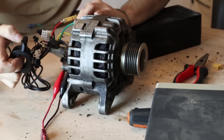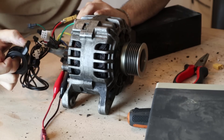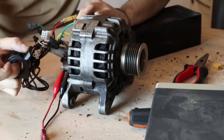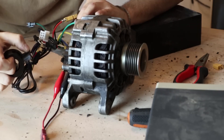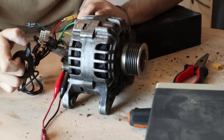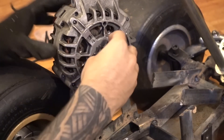Connect your battery. I'm using a lithium one, but you can use a car battery or any other with the correct voltage. This one is 36V, but there's a 1500W controller that uses 48V, so connect a 48V battery for that. You always have to supply the 12V we discussed to the central coil, because if not, the engine simply will not run, or it will run very weak and lazy — it will not be useful at all.